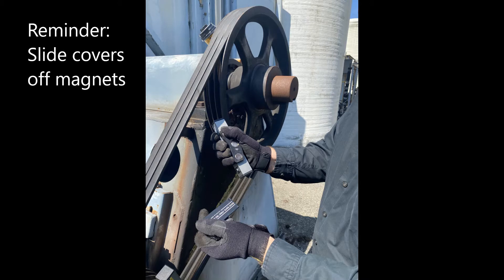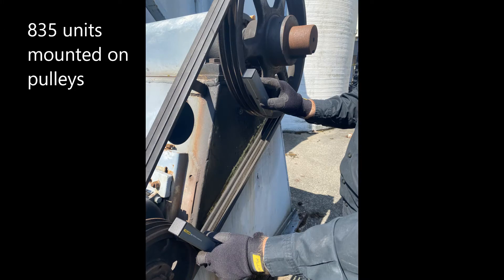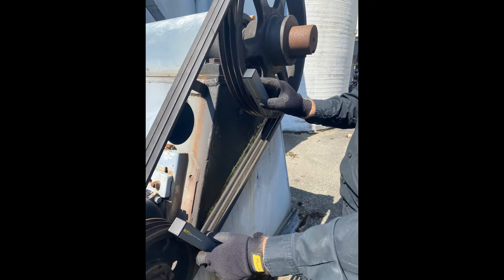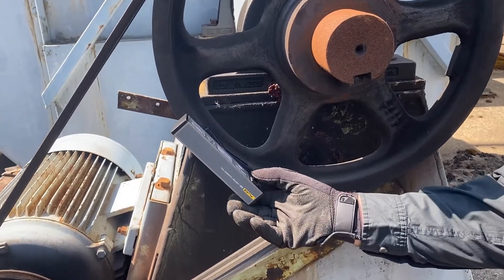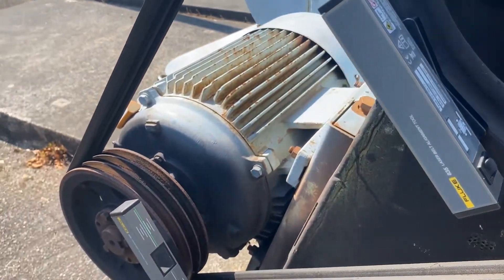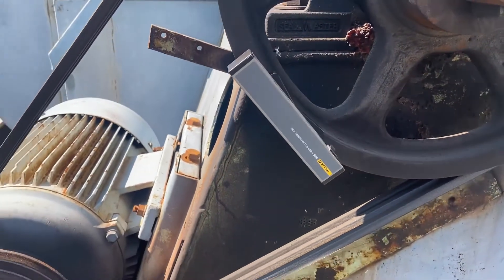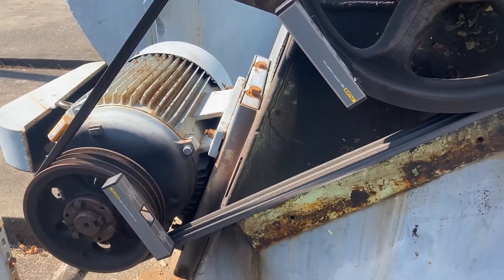Step 2 from the quick reference guide. In step 1, we mounted the 835 units. Now we will power on the 835. Here we see a machine with the 835 units mounted on the pulleys. Press the button on the laser unit to turn on the 835. See the green laser on the reflector unit, then see the green laser reflected back onto the laser transmitter unit.